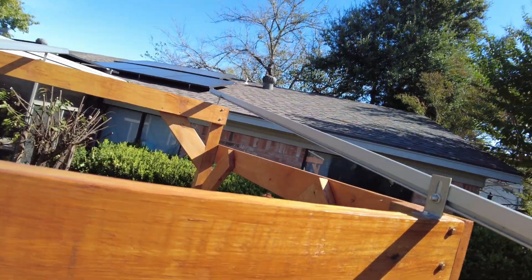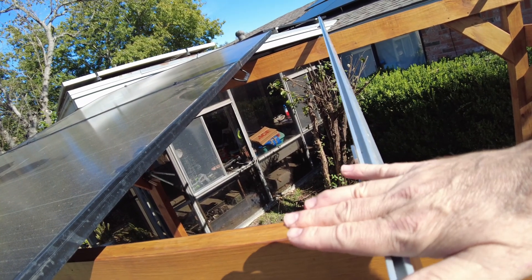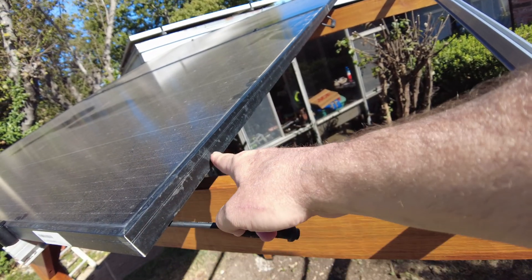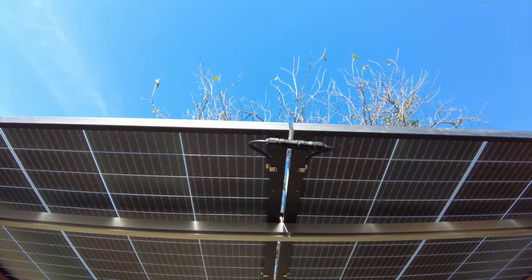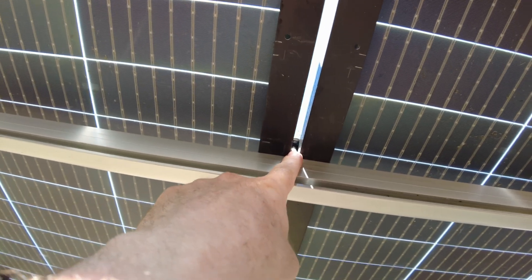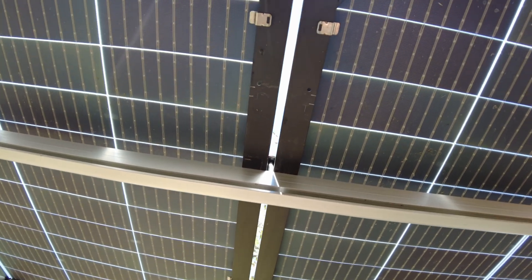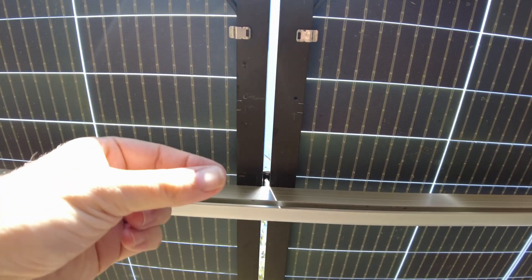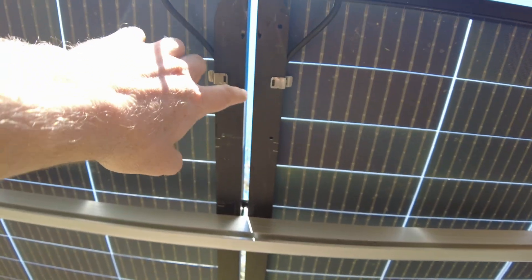Let's take a look from the upper side. When I put these other panels on, they're going to butt all the way up to these panels right here, so I might shoot a bead of silicone between here just to seal it off. But there is going to be a gap between these because there's a bolt that goes through to secure the panels, so it has to leave this gap. I've come up with some ideas — I've seen something called a backer rod, which fills in space so you can put caulking in without gooping a whole bunch of caulk into the crack.